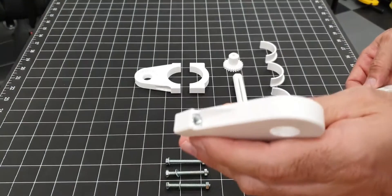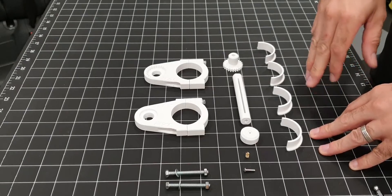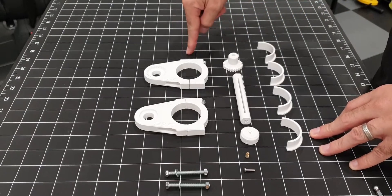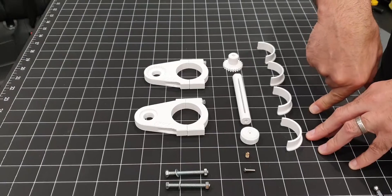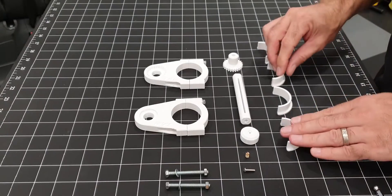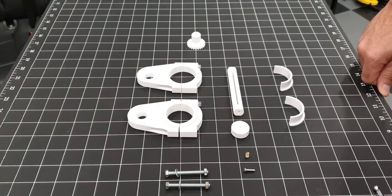A small tab of glue will keep that nut in place. These four here are packers for the roll cage - my harness bars are slightly smaller than my main hoop, so I designed it for the main hoop size. The main hoop bar is 44.5 millimeters, about an inch and three quarters, and with the packers in it allows me to go down to my roll cage which measures 40.2 millimeters, about 1.5 inches. They snap in like so.